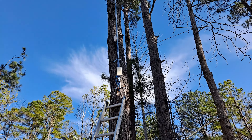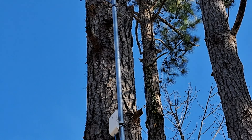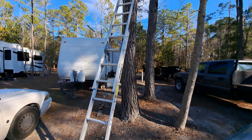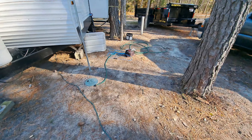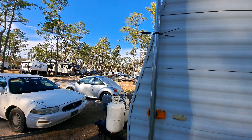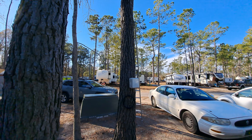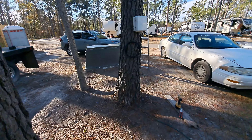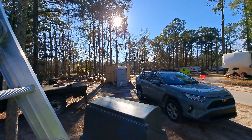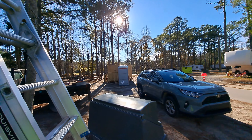There's a switch on the bottom of the pole - that's basically for the cameras in the park - and then I got the AP up there for all the RVs. Got it all off the pole and up on the tree. Now we've got to dig up this pole and go over there to install another client. I measured the fiber running across the road and it's a little over 16 feet - bridges and overpasses require 14 feet and up, so 16 should be more than enough.